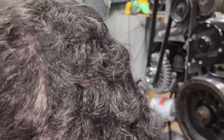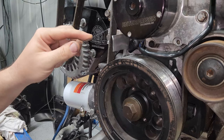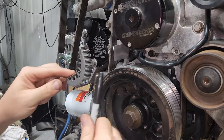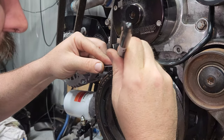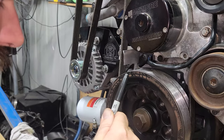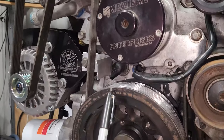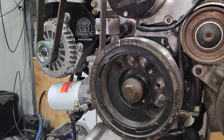So we need to mark 18.5mm — I probably should have used thicker steel but that's all I have, so we've just got to not touch it. 18.5mm puts it about there. I'll use a scriber and scrape a little notch in — that's probably better. Nice little notch there. We'll use a timing light to find it later on. That's our TDC for cylinder one.